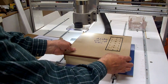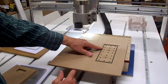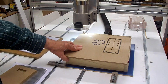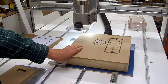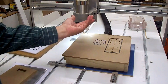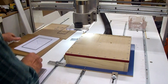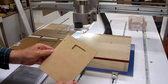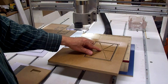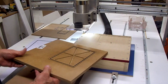A little while back I made this vacuum template to go on my vacuum fixture to machine out the sides of my pickup winders, and it worked out pretty decent. I did some research on YouTube videos of vacuum fixtures and found some aluminum ones made a little differently — instead of having a lot of holes, they have one hole with grooves for the suction to channel through. So I decided to do some experimentation and made one for the fronts and backs of my pickup winders out of MDF, just drilled one hole, put some grooves in it, put the gasket around it, and it worked out pretty decent.